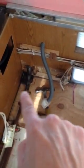Well, what was going on? This corner of my top was not coming up all the way to the height as the rest of them. Things like 48 inches. So over the winter I was messing around trying to adjust the cables and it wasn't helping, so I started looking at my cable hardware, and here that corner of the plywood particle board rotted out. It let that pulley come forward to way over here, so that let that spring not be raised up as far.